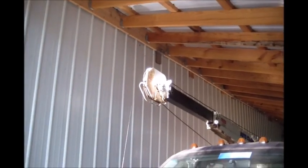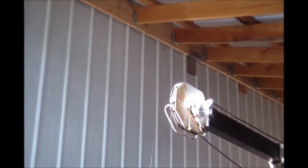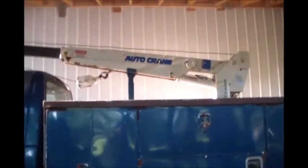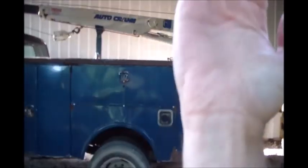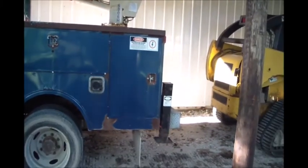Also, in the boom with this configuration, you can't just pull straight off the nose because it's got plates that force that wire to come over at least 90 degrees. Granted, if those weren't there, it'd be a lot easier to just have the boom pointed straight back and pull along the length of the boom. In some of it, the boom was actually facing backwards, we would lay the boom backwards, then tighten the winch up, and try to pull the boom back to us.